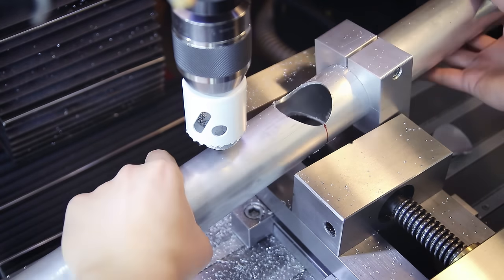Here are the two sides fully welded. They go back into the fixture one last time to do the final alignment. As expected there's a little bit of distortion — you can see the angle is slightly off on one side — but it's nothing too dramatic, so I can fix that by just forcing it back into alignment using the same fixture for support and to check against.